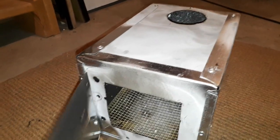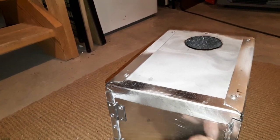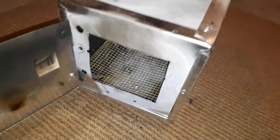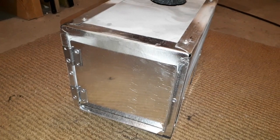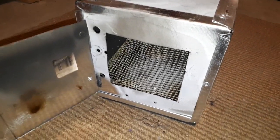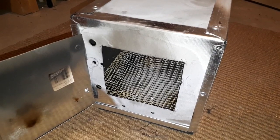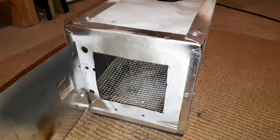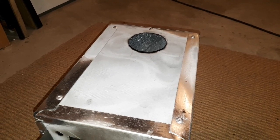I have burn tested this one. I put a couple of air holes in here just so the door sits flush. These holes were left over from a smaller door I had on there — I was thinking I needed some air, but just the fact that the door doesn't sit perfectly tight and there's a few holes in the corners means there's enough airflow to keep it going. In the bottom I put some chicken wire to keep the wood and fire off the bottom and give a little airflow underneath. There's a cut-out for a standard three-inch chimney piping on the top and that works quite well.